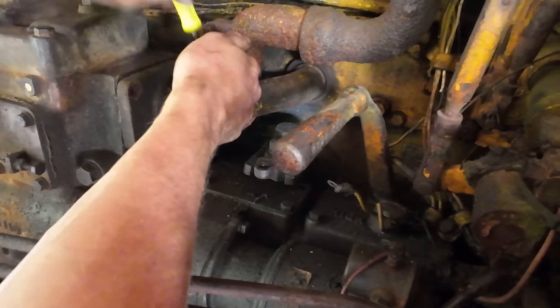Right like that. All right, we're underneath the machine right now, and we're looking for the two mid-mounted engine mount bolts on the pony motor. I was a little disappointed. This is the first I've really climbed underneath this machine, and a little disappointed that somebody's come in here and cut access holes in the belly pan. But at the same time, they're going to work out in our favor right now, because I think we need to go through here to get to the bolts we need. Yeah, so if you contort your neck just right and look up past the dripping coolant there, there's two bolts up under there that we need to get out.